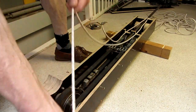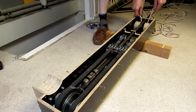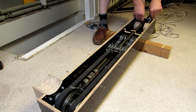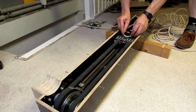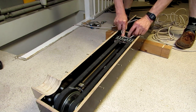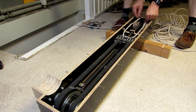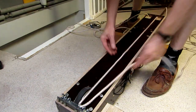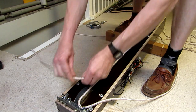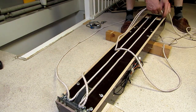Before mounting the top plate, we first have to mount the bungee cord. Each actuator has around 15 meters of 8mm bungee shock cord. The center of the bungee cord loops over the drive shaft. Then it goes back and forth between the drive shaft bracket and the actuator bottom bracket. In total, you'll get 10 strings of bungee pulling the drive shaft upwards.